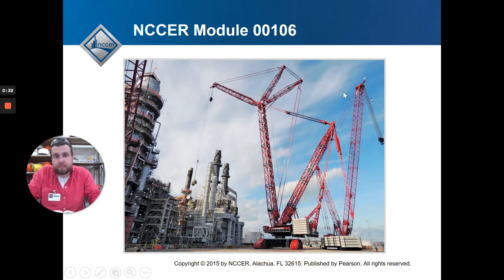We're in basic rigging. Rigging basically means anything that is getting picked up. This is a crane in a factory - if you're using some kind of machine to pick something up, the straps and everything from the hook down is your rigging. If you're working with cranes, always keep your head on a swivel, always be paying attention, because you're lifting things that are thousands of pounds, multiple tons. If you're not paying attention and something hits or crushes you, you're dead.